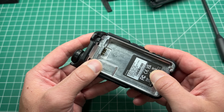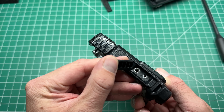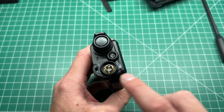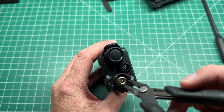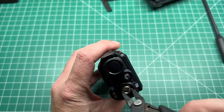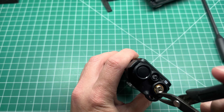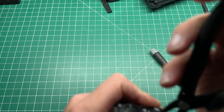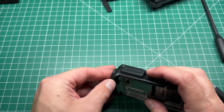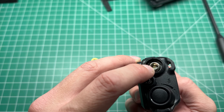There are no screws in this radio — I can't see any screws at all. So we've got to get this SMA nut off first. Does anyone know if there's a tool for this? All I usually do is use a pair of pliers, which is probably pretty bad. It's gotten tighter — I think I've been tightening it back up. Is it righty-tighty, lefty-loosey? That took a lot to get off, and I think the end was cross-threaded — that's why it wouldn't come out.